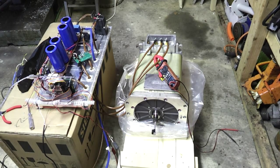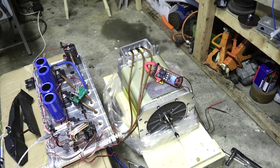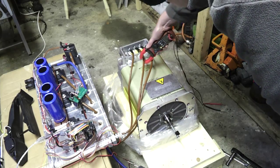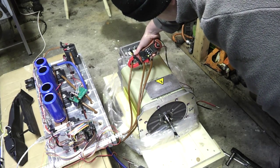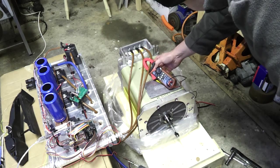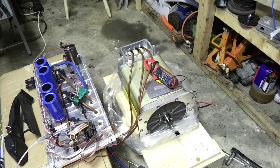I've got a multimeter measuring the AC phase current. One smart thing to do would be to measure all three phase currents and see if they're the same. There's about 2.5 amps on that phase, 2.5 amps on the second phase, and again about 2.5 amps on the third. So it's not like the motor is single phasing - indeed it might run single phase but it wouldn't start without all three phases being operational.